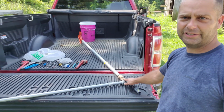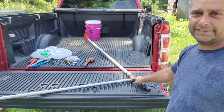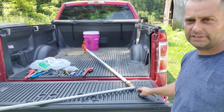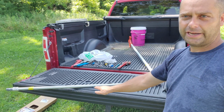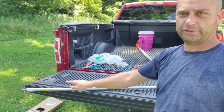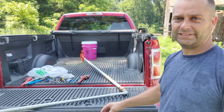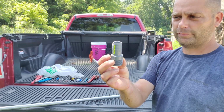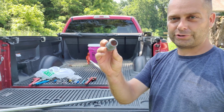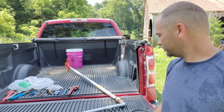So I came out with an elbow out of the bottom of the hydrant, and instead of just hooking on with my rolled pipe here, the reason I put a piece of galvanized pipe on there to extend it away farther before we hook up our rolled plastic pipe to it, is because we're using a plastic barb fitting, and I don't want undue stress on this and this to break. So this is probably the weak link in the whole system.